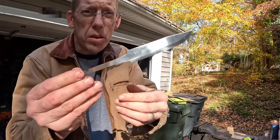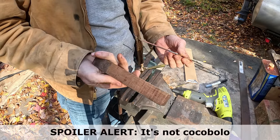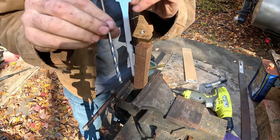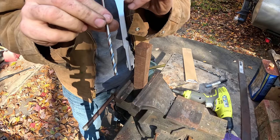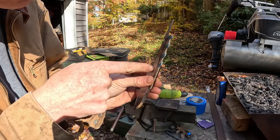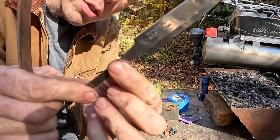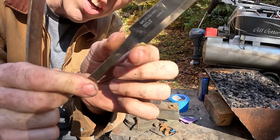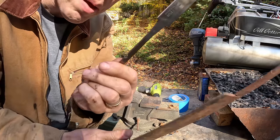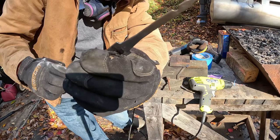Let's start with the Mora knife — the tang is flat and funky shaped. I think this is a piece of cocobola I found in my scrap wood pile. I'll need a 3/16th drill bit for this portion of the tang, and it needs to be a little bit longer than the typical drill bit. Then I'm going to use a 5/16th drill bit to drill out the wider portion. We've got a flared neck on the tang, so I'm going to take a 1/8th inch piece of steel and cut out a little pattern that exactly matches the neck.